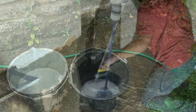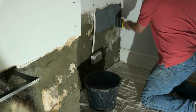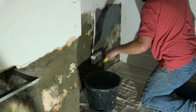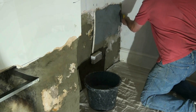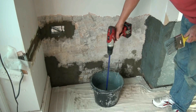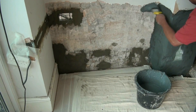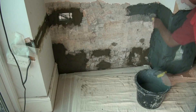Clean the tools thoroughly. Use a large masonry brush to brush the tanking onto the wall in horizontal lines — don't brush it out like paint. Get plenty on and make sure you've got a uniform thickness. You'll need to keep whisking the slurry to keep it workable, with the cement not sinking to the bottom, and carry on until you've done the first coat on the wall.